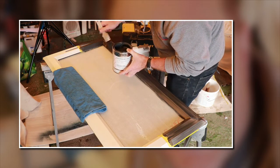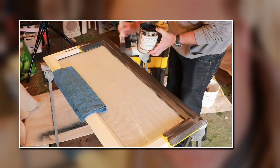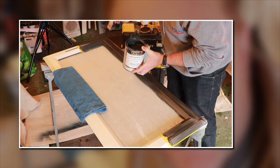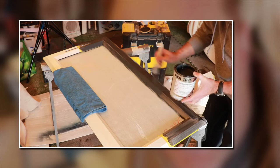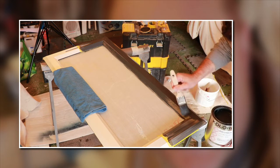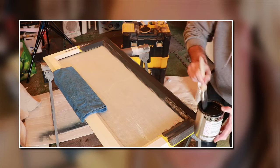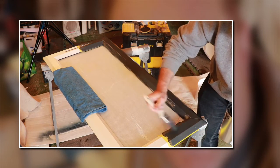It's never going to be easy trying to get a dark colour covering over a light colour. Probably if you've got a mint green or some of the sagey colours that are popular on UPVC windows, you'll probably find they coat up better for two coats. But as I said I'm giving it three - doesn't matter about two coats, we're giving it three. Trying to lay off now as it's starting to pull - when I mean pull, it feels like it's drying on me. Not trying to overbrush it but also not trying to put too much on. What we don't want in a real life situation on a house is runs - like with any painting you don't want runs. I've put enough on without flooding it.